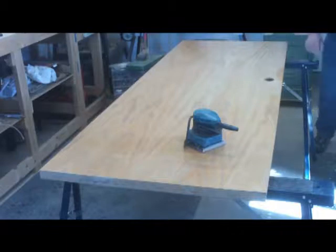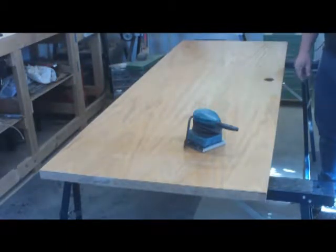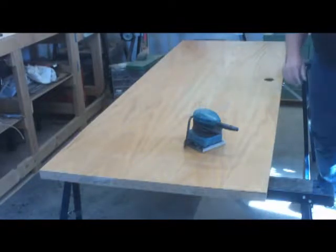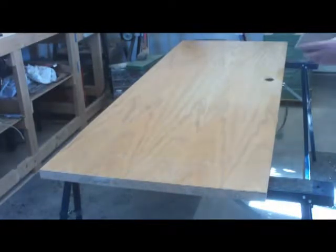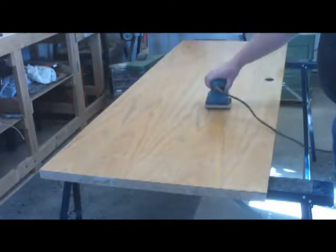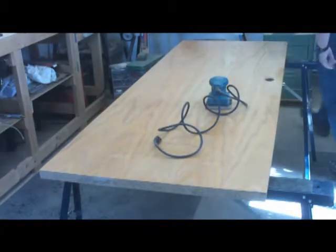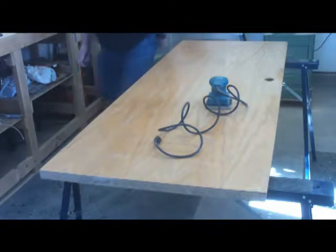So it seems like this door is an oak door. I'll probably just take some oak sawdust and mix it with some carpenter's glue and then sand it and stain that as well. It's a method I use for most of my wood turning, so I think it'll work really well with this door as well.